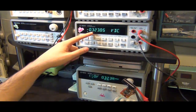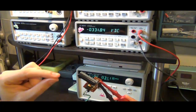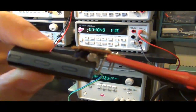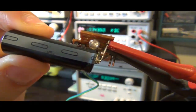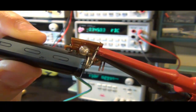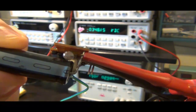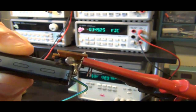At the same time you can see the voltage up here - now it's at minus 324 to minus 326.7 volts. I have to be very, very careful handling this now. You can see that little light flashing - that's the little neon light I was telling you about. There is actually a little quiz in this episode that I'd like to see you guys try and discuss on the forum or in the comment section of the YouTube channel. The question is: can you tell me why does this light flash? In the LED version, if I were to replace this with an LED, the LED will not flash. So let me know why you think this is flashing.